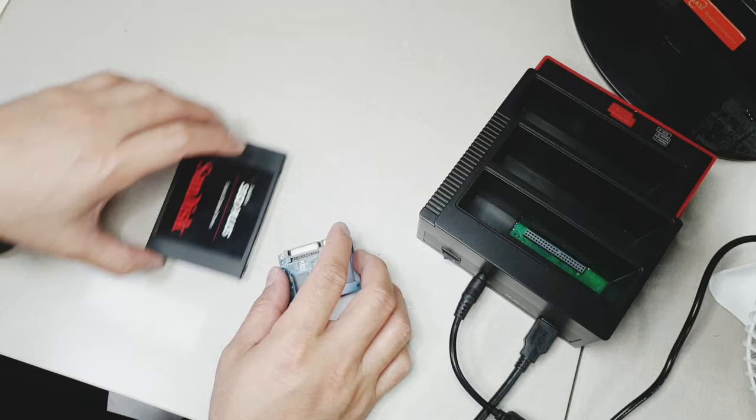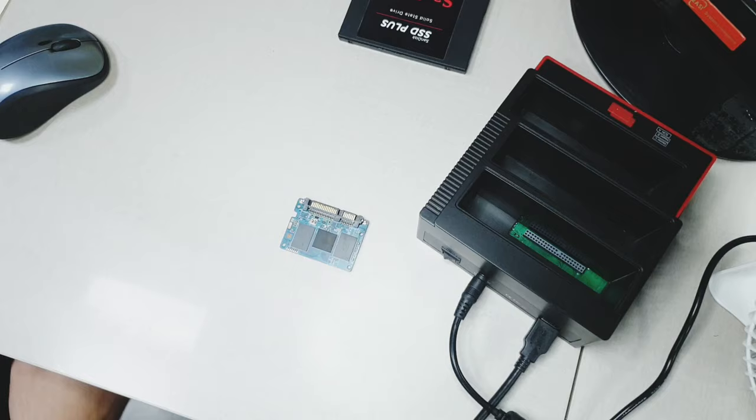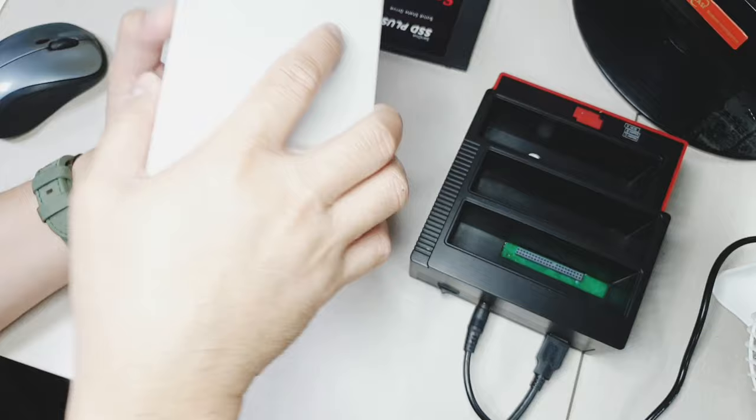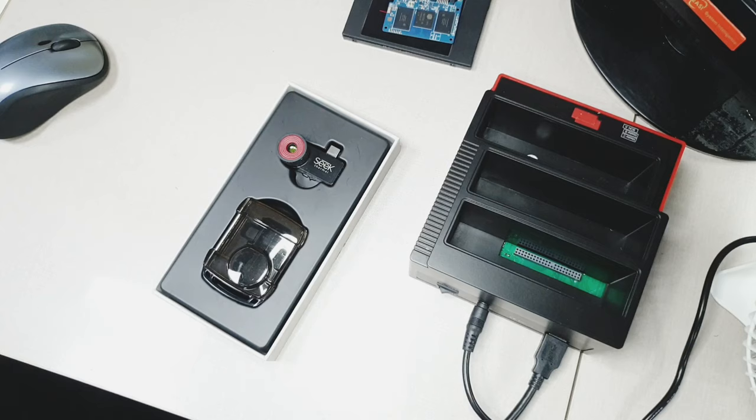Now the first thing I would like to do is to bring out my Seek Thermal Compact Pro camera. This can save me from a lot of trouble of going through the components one by one. By using the thermal camera, I can easily find which component is getting hot after injecting power to the logic board.